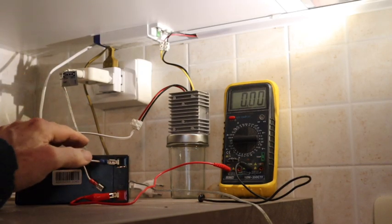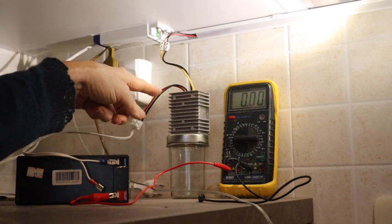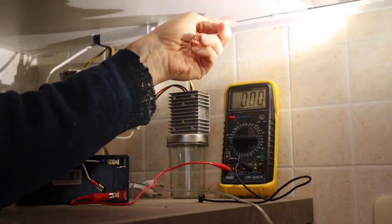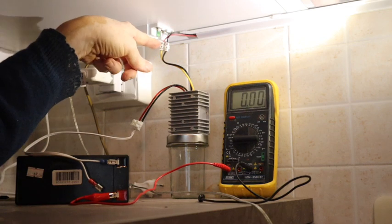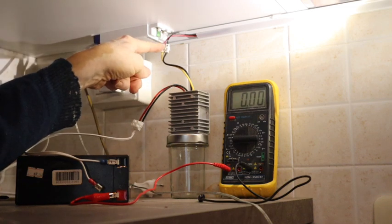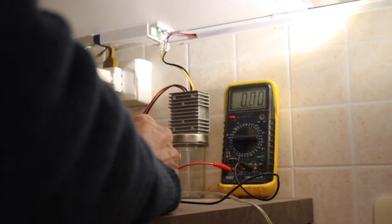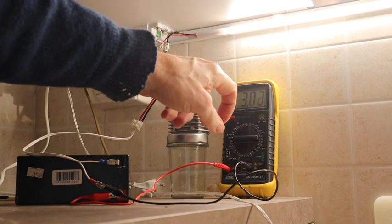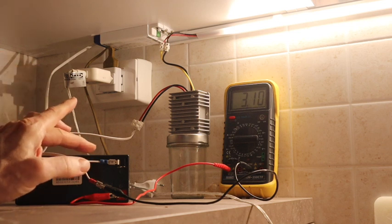Let's look at the application of the 12V battery. I took the light one because it's portable, and in combination with a 24V DC transformer, we tried the LED strip which we know runs on 24V. We took the connections from the DC supply and put them on the 24V output of this transformer — stepping up from 12V to 24V. We are now measuring the current and see nearly 3 ampere. That means with the 12V battery we are delivering 36 watts. I also tried it directly on the battery, but that doesn't work.